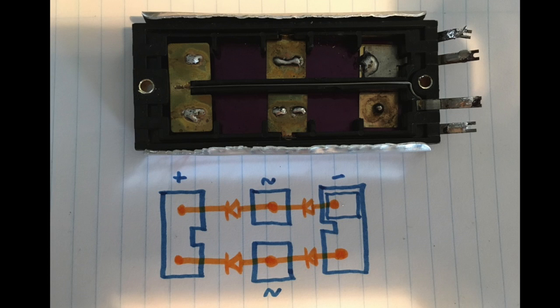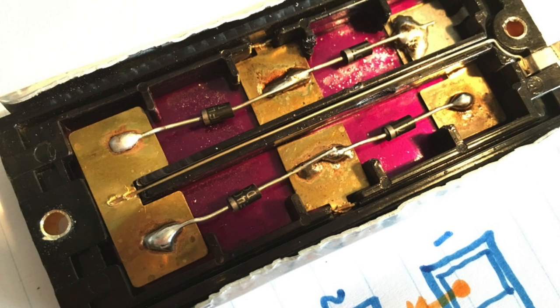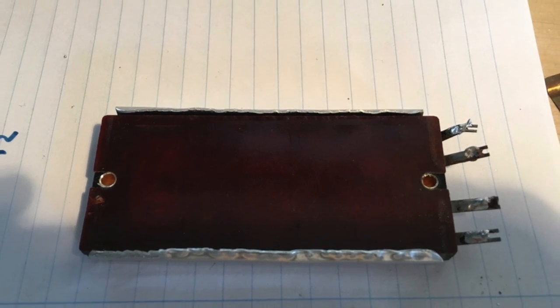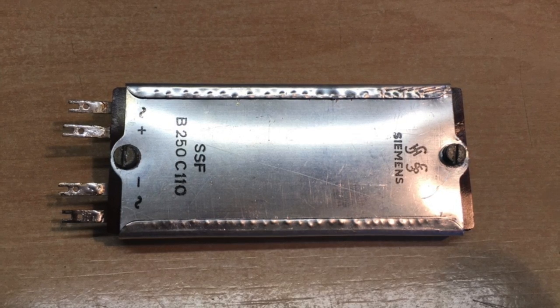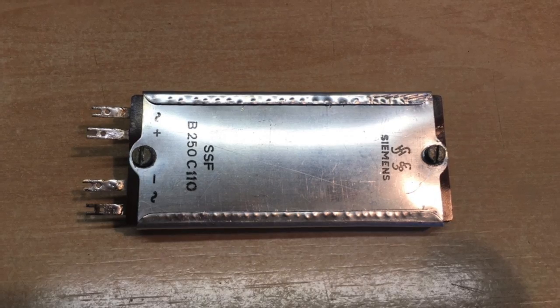The next thing to do is to tin the brass connectors so you can solder the diodes to them. These can be quite difficult to tin, so the best thing to do is to remove them, tin them outside, possibly use some flux, clean with a bit of steel wool, and the solder should adhere quite well. When the diodes are soldered in, check for connections and make sure the solder joints are solid — you do not want to open this up later if you've made a mistake. Then mount everything up again, put the various layers back, and gently hammer the lid back into position for a solid connection with as little damage as possible.